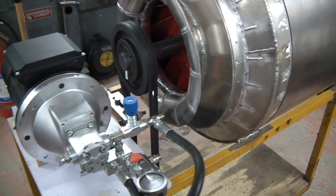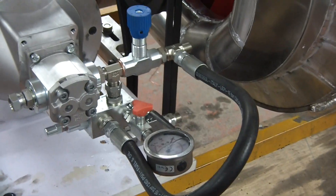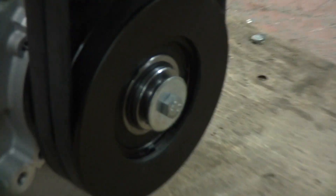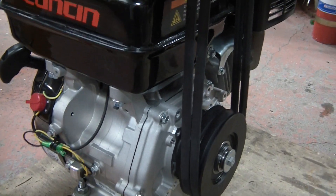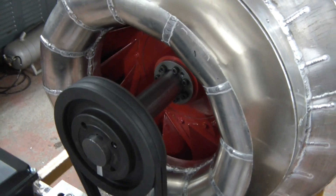So far, the plan is to use a hydraulic pump with a very large one-phase electric motor to power the fuel. For now, I'll use a pulley with a centrifugal clutch on a nine-horsepower four-stroke engine to start it. This won't be the way I start it later, but for now it's just to get it spinning.